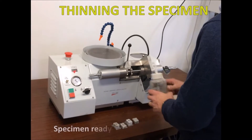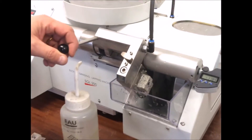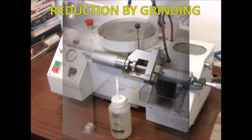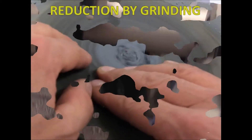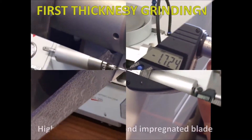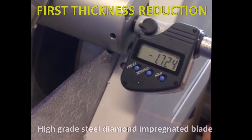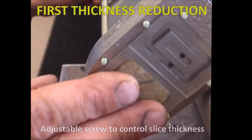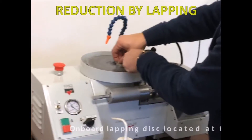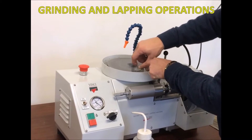The specimen is now ready for meticulous thickness reductions down to 30 micrometers. Two techniques are available. The first technique, also called reduction by grinding, consists of using the multi-purpose SGL200 machine which can slice, grind, and lap. The specimen thickness is first reduced to 100 to 500 microns by a high-grade steel diamond-impregnated blade. The latter is transferred from the cutting blade to the grinder by means of a manually rotated wheel. An adjustable screw controls the slicing thickness and a precision micrometer monitors grinding thickness. Lapping is performed with the onboard lapping disc located at the top. The same machine can also be utilized for initial grinding and lapping operations prior to bonding.